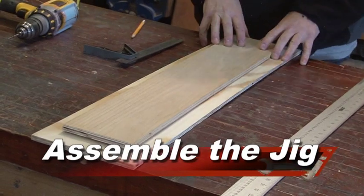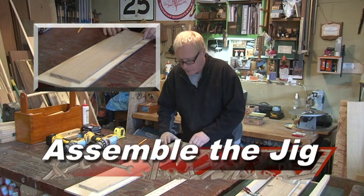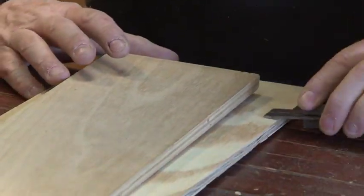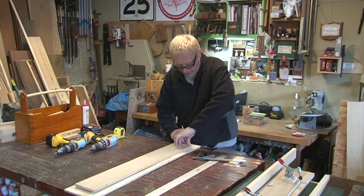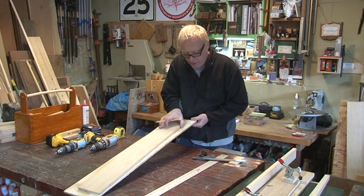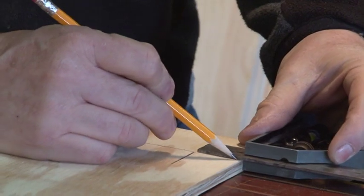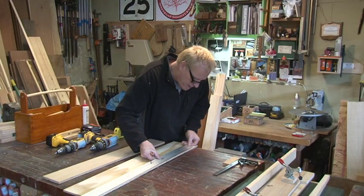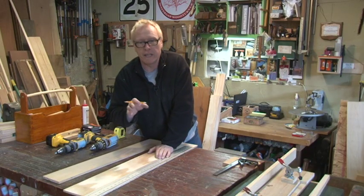We have our two pieces of plywood for our jig. I want to make sure my top board doesn't overhang the base plate. I'm going to take my combination square and butt it up against the base board, hold that in place, and draw a line at the back. That shows placement of my top board right off the back. I extend this line over, draw another line — that is where I start measuring down the length of the leg. In this case it's 23 and 7/8 inches long.